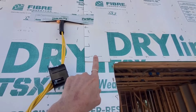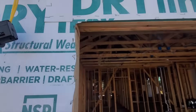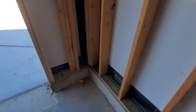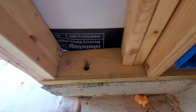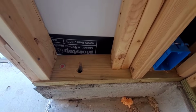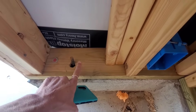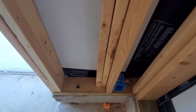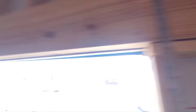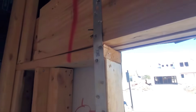The fasteners — you should have a grid pattern of fasteners every three inches, vertical and horizontal, where this sheathing meets this header. Inside, you can see there's no nut or washer on either of these anchor bolts, and these are the wrong size anchor bolts. They should be 5/8 inch with a 2-by-2 washer. There should be not one but three of these boards — three bottom plates tripled up. And you can see this giant gap right here between your header and the studs. Same thing over here, so that needs to be shimmed up at the very least.